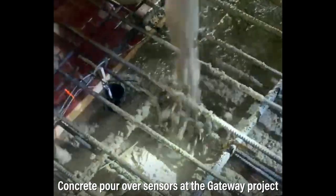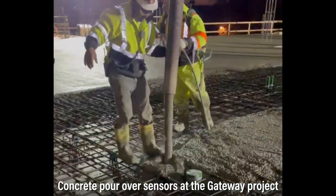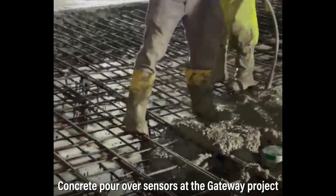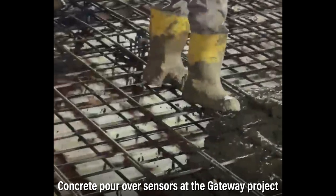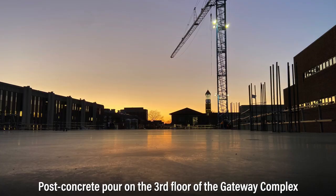Instead of all the pre-planning that may take place, decisions can be made quicker — for example, if you want to change the concrete mix design for a specific pour. And instead of needing 28 days prior, it'll help with the speed and accuracy of predicting the in-place concrete strength. Thank you.